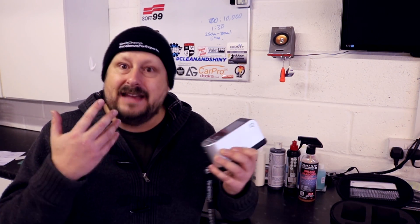The machine also measures haze. Imagine a beautifully clear panel that you've wet-sanded — that will introduce hazing. Or if you used a very opaque, murky product over the surface, that would introduce hazing too. In detailing you're looking to deliver a surface with as little haze as possible, and this machine can measure it. That's very relevant when offering wet-sanding services; you can go around, check your work, and make sure you've removed all the sanding haze from the finish.